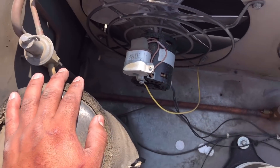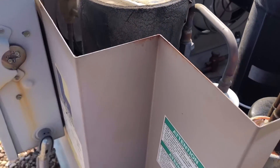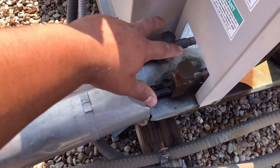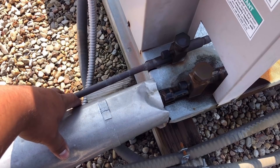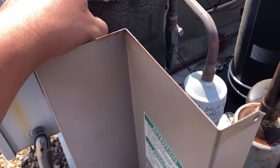What I'm thinking about doing is opening up the solenoid, letting as much refrigerant travel down to the evaporator, trap it right there by front-seating these two valves — trap some refrigerant in here — and that way I only have to recover what's left on this back side.